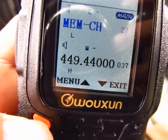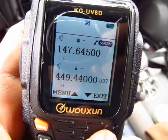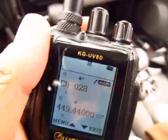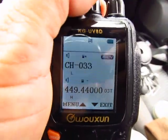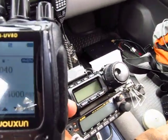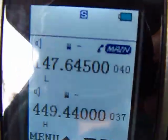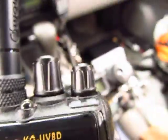It's saved. Press exit — everything is saved when you press exit. Now let's go to memory to verify. We're still in VFO, so go to memory mode. Navigate to channel 40. Press VFO/MR one more time to show the actual frequency — 147.645, channel 040. We're in memory mode now. Let's see if it activates.